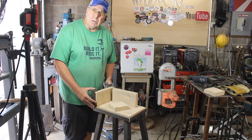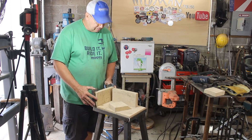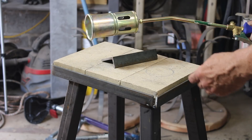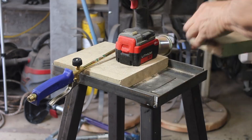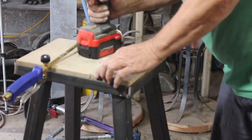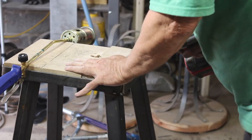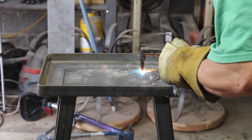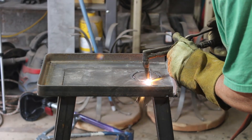Now we need to build the walls and all I'm going to do is make an angle iron framework and we'll just set the bricks in place. Here's where I'm talking about using a weed burner as the heat source for this forge. Naturally I forgot to turn the camera microphone on so we didn't get any audio of that — but who wants to hear a bunch of drilling anyway, right? Rather than fire up the plasma cutter to cut the hole into the floor, I just decided to break out the cutting torch because it was handy and easy.